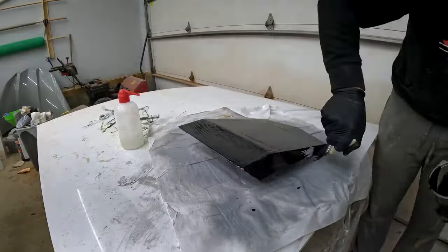Next morning — I got up early, knocked this out, and it's actually not as bad as I thought. I'm kind of regretting making it out, although it might go back in. I'll fill the gaps with some wax and go from there. Using a mixing stick you can see there's a half inch to three-quarter inch gap in one spot, but on the other side there's zero gap. What happened was this turned into essentially an oven — it cured and pulled away, then got so hot it actually warped the piece. I put my thermal gun on it when it was getting hot and it was 210 degrees Fahrenheit.